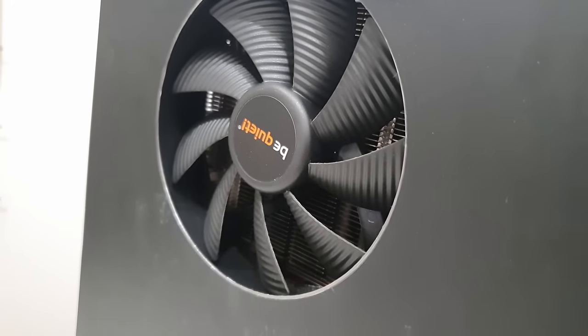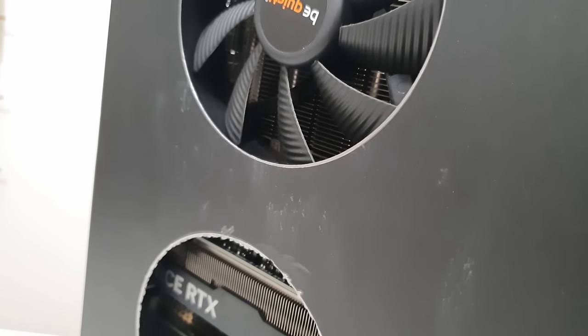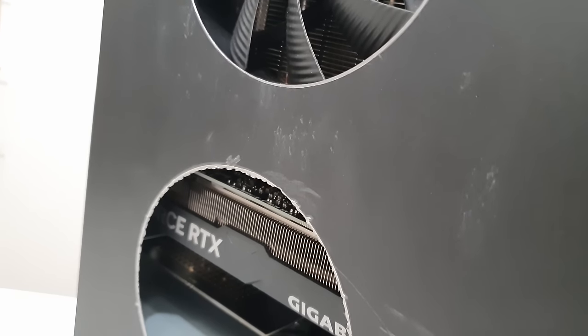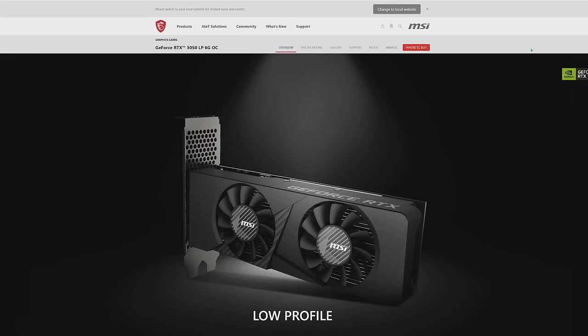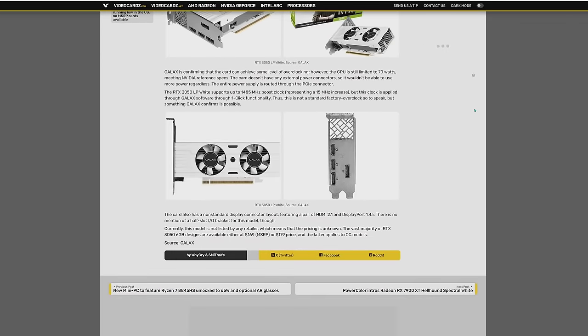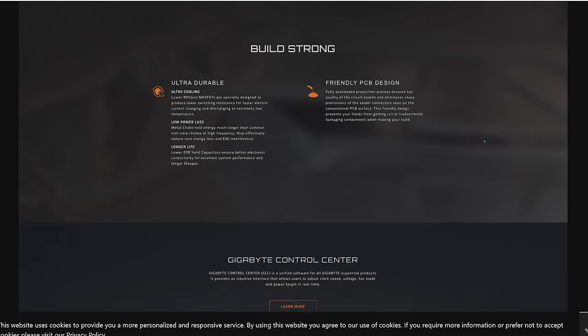Another concern is cooling of the 4060 inside this chassis. Right now it's winter and I have low ambient temperatures — sometimes below 20 degrees Celsius — so cooling isn't that hard. But in summer when ambient temperatures might reach 22, 24, or even 25 degrees Celsius, the GPU will most likely overheat. To solve this I would likely need to install an exhaust fan over the hole so hot air from the GPU is sucked out and not trapped inside. Another possible solution would be replacing the 4060 with a low profile 3050, which seems like a better match for the E5 2667v4 overall, but the 3050's price of almost 250€ and only 6GB of video memory make it impossible to recommend — the 4060 costs just a bit more and has 8GB of memory.